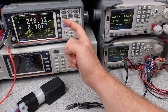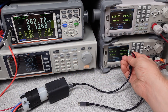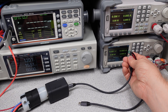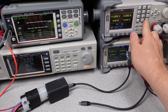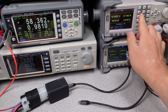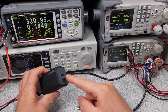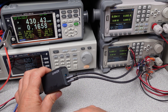The idle power settled out to an acceptable number — not the worst idle performance, but not the best. It meets the requirements though. For modes of operation, this adapter has 5, 9, 12, 15, and 20V fixed USB 3.1 power delivery modes — again, Anker including the 12V mode as an addition. The power adapter also has a programmable power supply mode at 11V and can do up to 5 amps, so this should support 45W Samsung super-fast charging. The power sharing is different on this one — it still renegotiates on plugs and unplugs, but it is so fast on unplugs that the meter doesn't actually register a change in 5V mode. This shows some improvement on plug and unplug of devices.